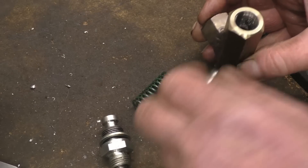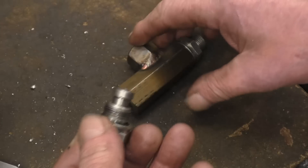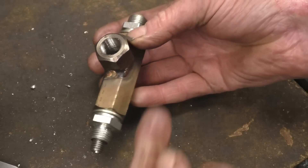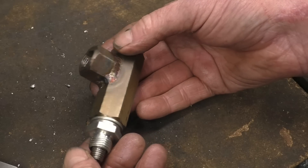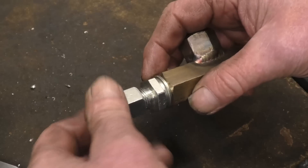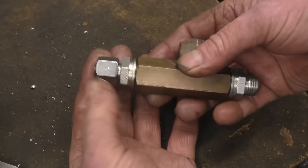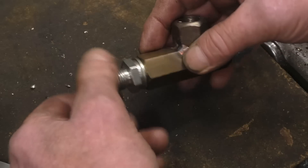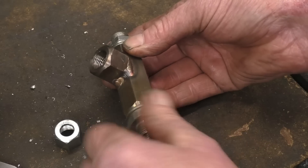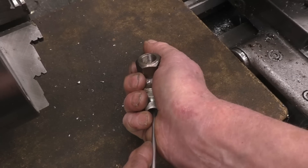Right, that's basically all the parts made now. Ball goes in, spring goes in, that's the adjuster for the pressure - that's the part I've just made. That goes into there, then that can be turned down to put more pressure on the spring to increase the pressure. A little harder to make for the end of there, and as the nut goes over the top, I'll put some packing in and that will stop any oil from leaking out that way. Now I'll put a little bit of compressed air into there, put a gauge on, and see if I can drop the pressure. You can see the little ball in the end of there, and that gets pushed off the seat by the pressure, and the excess oil comes out of that port there.